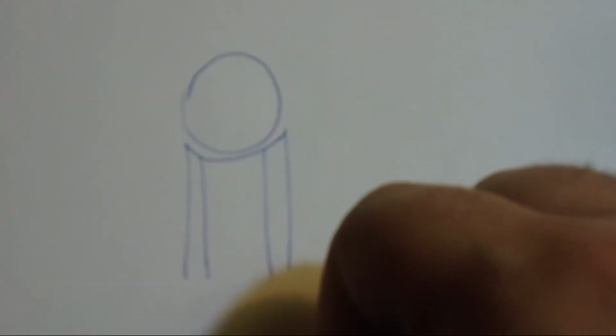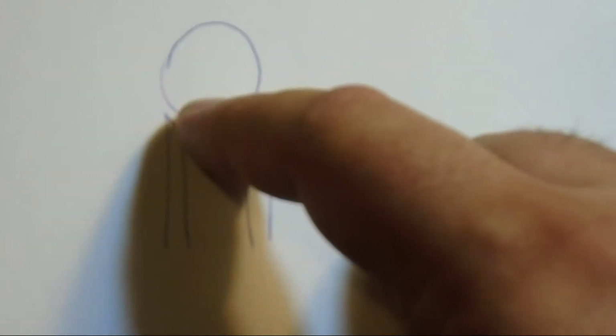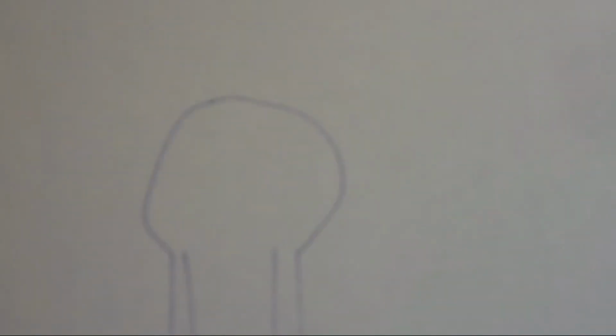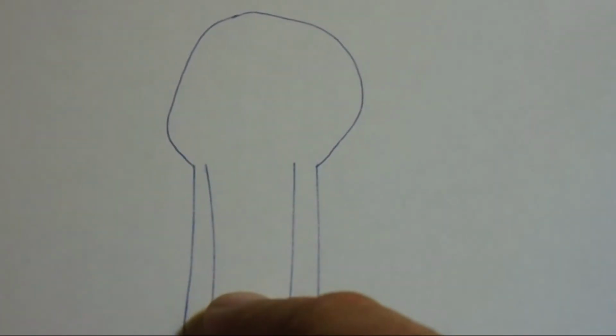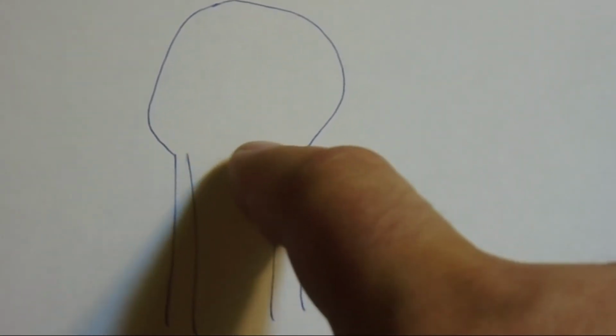But what I definitely suggest, and what I did, is I got rid of this ridge. That ridge is very bad for your reliability. It does absolutely nothing for you. So I went ahead and flattened that out with a file, and the gun works a lot smoother. I went ahead and made a drawing of more or less what it ought to look like when you're done. You've got your feed ramp here, and it's just blended in with a file.